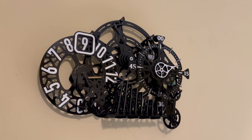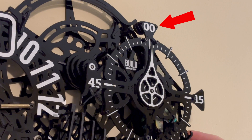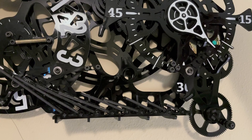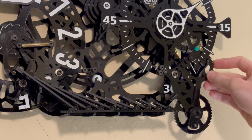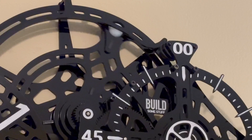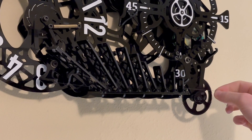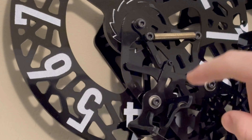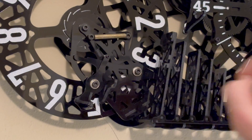This is how all these different systems will work together to advance the hour. To start, a marble will rest here, then once the minute hand reaches the zero-zero point, this pillar falls down and hits the ball, which will start rolling along a little slide and keep rolling until it gets to this mechanism, which kicks over the dominoes. The ball will roll back around behind the clock and into this opening, and wait to be carried back up by this central ball elevator. Then after the dominoes have been knocked down, the last one will hit this little lever, which will release a spring-loaded ratchet system, advancing the hour. The ball will be reset with this elevator that's spinning around and then drop it off right here, and the dominoes will be reset with a string system that, when pulled, will reset all the dominoes back up to their starting positions. This crank is going one revolution per hour, and that string is also pulling this lever, which resets the spring-loaded ratchet system before each hour. Everything else, like the kicker and the ratchet stopper, is just reset by gravity.